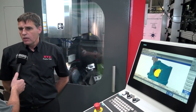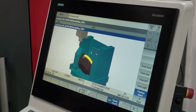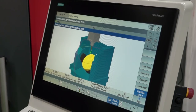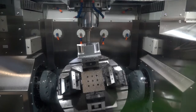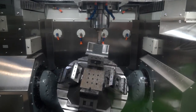You've also paid a lot of attention to detail for the user — tell us about what you can do with the Siemens and the Heidenhain control to protect yourselves from having a collision. Yeah, we've fitted quite a few things but one of the most important is the dynamic collision detection. We've got a model of the machine in the control and as we move the machine either manually or in full program mode, the machine is checking itself to make sure there's no collision between the head, the table, and you can also build the model up to include the fixture. So even if you were going to collide with the fixture itself, the control would stop the machine and highlight in bright red that you've got a collision coming on.